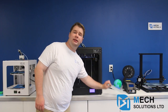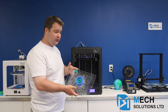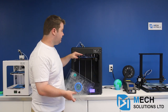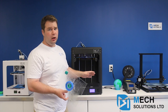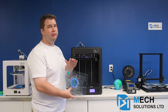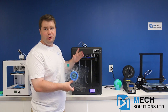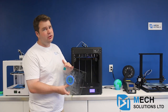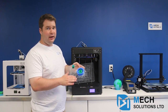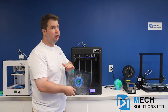Printing with the glass bed does have a couple of major advantages. First, after you finish the print, you can simply just take off the glass bed, let it cool, and start printing again, whereas if you use the standard bed it comes with, you're going to have to wait for it to cool off, remove the printed object, and then start printing. So it can be quite a time saver, especially if you're using the CR5S constantly. It also has the advantage that if you accidentally make a mistake — the nozzle head is too close or something breaks — it breaks the glass, which is a lot less expensive and much easier to fix than breaking the bed itself. So there are some major advantages to just using a glass bed.